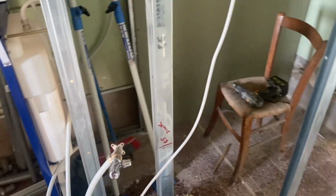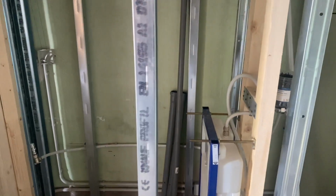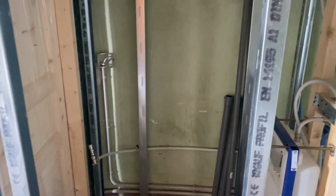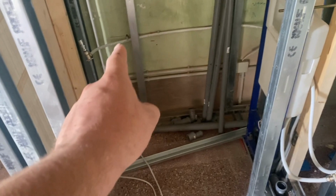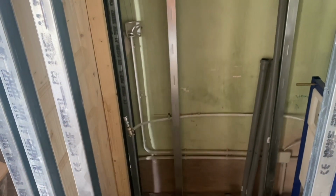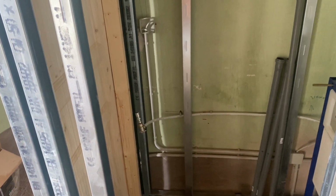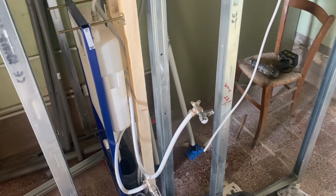Okay, so the water has been connected for pretty much 48 hours. Everything's dry, so that's very good. What I'm going to do now is connect up the wires there for the lights, and then run the wastewater pipe for the little sink along the wall there, and then put in a piece of wood to reinforce where the sink will screw onto. It's only a little tiny sink, so it doesn't need that much reinforcement. Up here in the front we'll do something a little more, but the sink actually will be sat on a shelf.